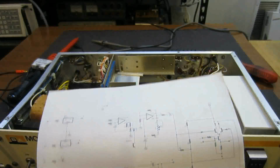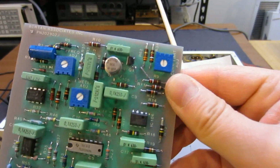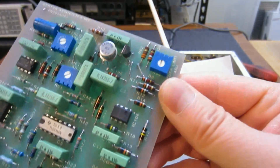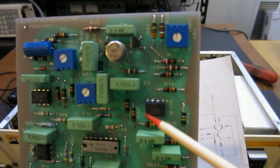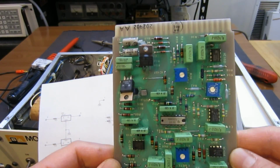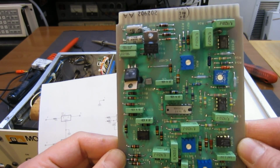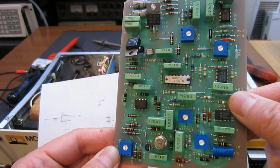And if you look at IC106, where is it? IC106, 104, 10. I think it's one of these. 106. Yep, that's right here. Okay, so this one drives the output of the signal. So anyway, I'm going to socket these ICs, and we'll go from there.